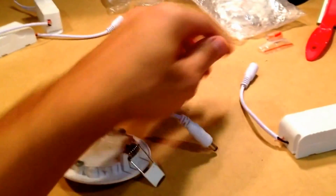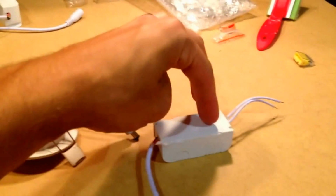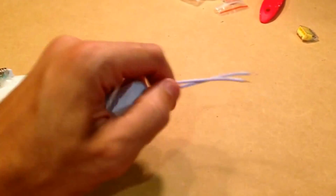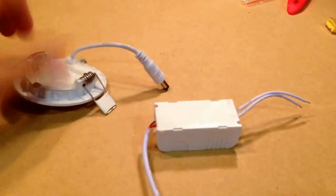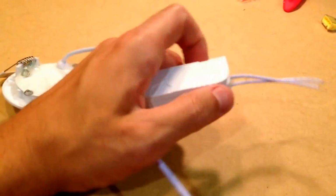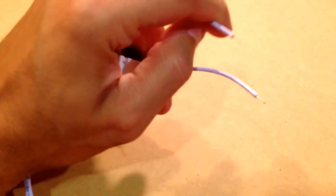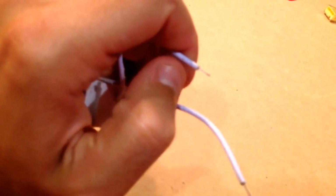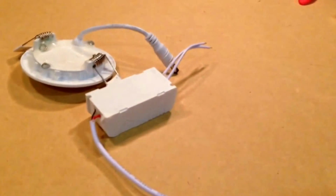And then the other component that plugs into this, the female side here, is the driver, and that driver just converts anywhere between, I think it's 85 to 265 volts incoming, into an output of, I believe, 8 volts or something, maybe 12 volts. No difference, no matter. But I also siliconed this edge here, because it's just a plastic housing. You know, put a latex glove on, and I did them all, just for another layer. There's just a little PCB in there that's a driver that takes the voltage and steps it down. They're little, I think these are probably 18 or 20 gauge wires. I strip them back so that I can tie into the line voltage that's outside before you put these inside the housing.